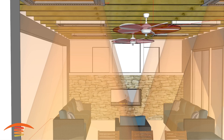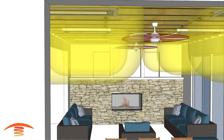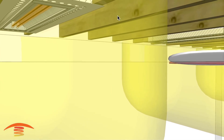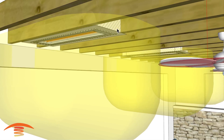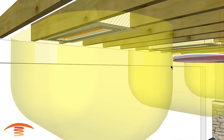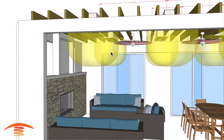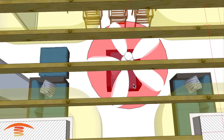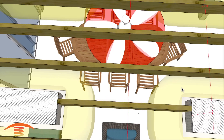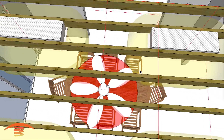There is a clearance issue to address here. I placed the units such that they're not intruding into the fan area whatsoever. You can see I moved it out just enough so that my 18 inches of clearance from the edge of the heater to the fan blade around this edge is not a problem — and that's true on all six units. Again, these are 4,000-watt units. Swinging over to this side, no issue. There are no clearance problems with regards to using these 4,000-watt units around the fans. These are the closest two I have to the fans, and they still meet the clearances.